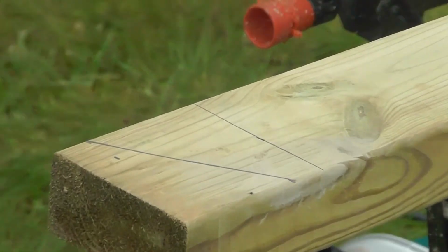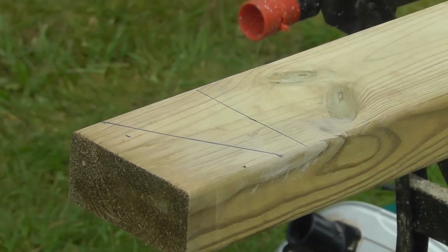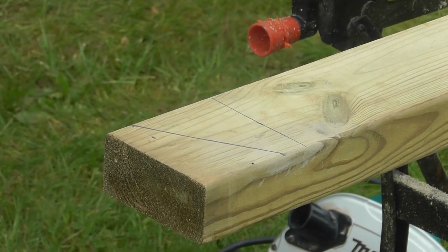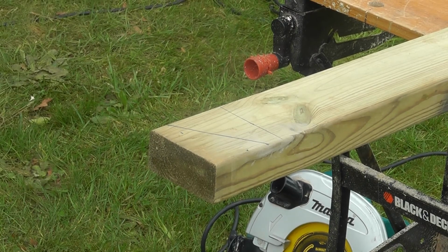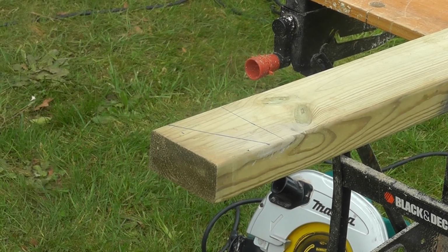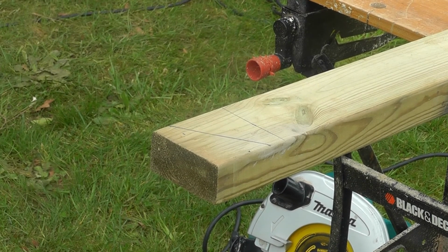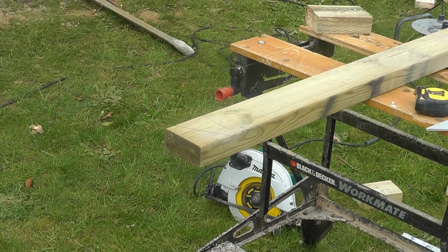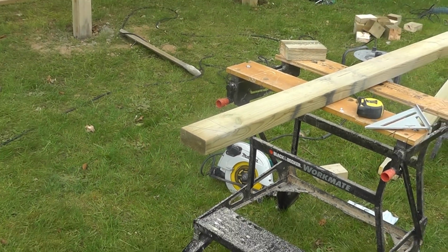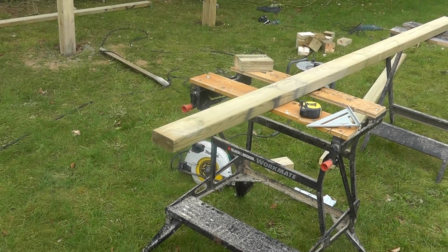So you can see there on the drawing, I've basically taken a 4.8 meter length because of the structure of this one and divided it into 2. So I've got 2.4 meter lengths now. The construction's 220, so therefore I've got about 9 centimeters either side to play with. Okay, so you'll obviously cut yours to your exact measurements. So I'm going to go away now and cut that.